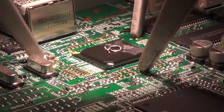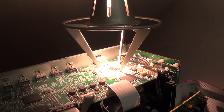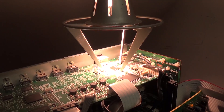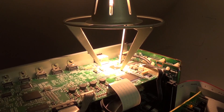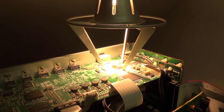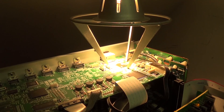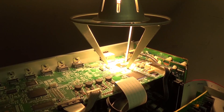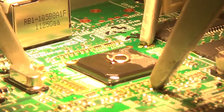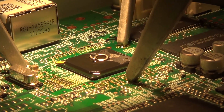This old fixture worked out quite nicely because it's got built-in little legs, so I can just stand it on top of the board. We'll let that thing cook. I've got the power disconnected to the receiver. Once the solder sitting on top becomes molten, it should be hot enough — or I'll let it go a few more minutes to make sure the solder underneath the chip is fully reflowed. And that hopefully will solve my problem.